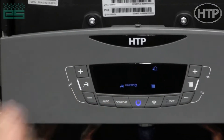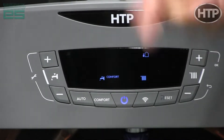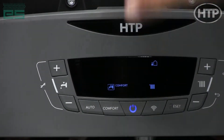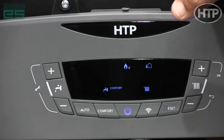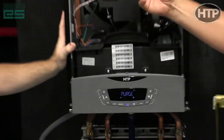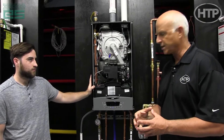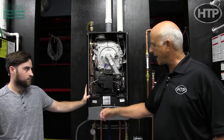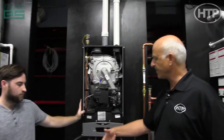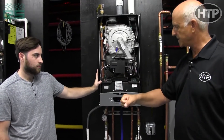We have this comfort function, and you can see here there's a time clock. The unit's going to come on now to preheat the braze plate in the back to 105 degrees, maintaining that temperature in the braze plate. We've tested this over an hour's time because a lot of guys are concerned about short cycling. But with the mass of the heat exchanger and the low volume we have in the braze plate, there are very few short cycles within the system. The comfort function just allows you to keep that braze plate warm, so when you need domestic hot water, you've got it right away.